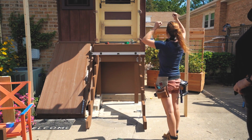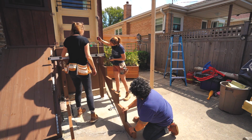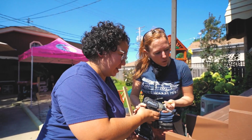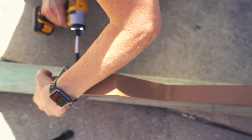Since you can't cut through a stringer, we moved it in just enough so that it would butt up to the inside of the post. We did the same thing for the placement of the far right stringer. And you can see that we're using the stair stringer hanging brackets. And I have linked to all the brackets down below if you have questions on what we used.